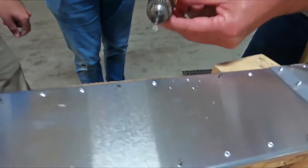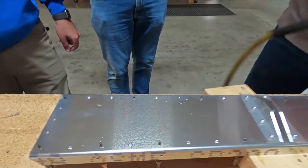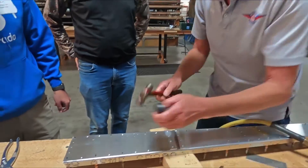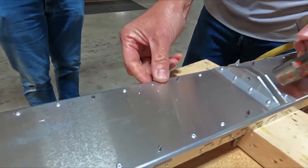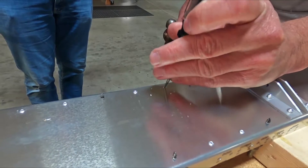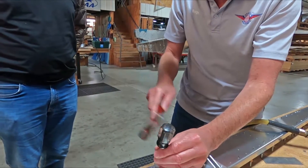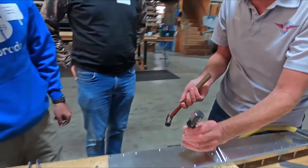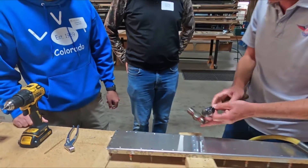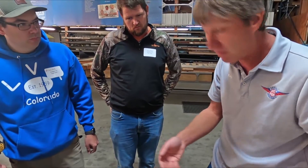A lot of times the head will come right off. Pull that head off, and as I was mentioning, since this is a very sturdy structure — it's not like a skin — you can take an awl and knock the steel stem down, and a lot of times it'll just bust right through. If you have to hit too hard, you might want to drill it again or take a pair of side cutters and grab it from the other side.